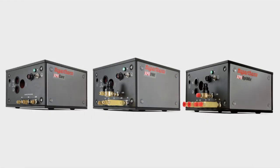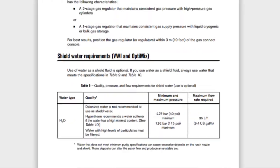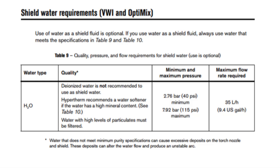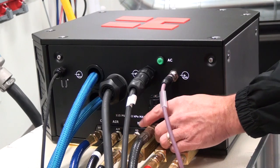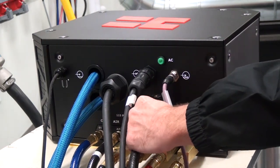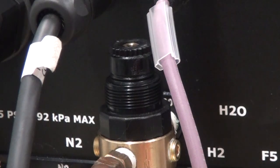If you are using a VWI or Optimix console, you will need to check the shield water regulator. The core console does not use this feature. Using Table 9 in the XPR instruction manual, ensure the water pressure being supplied to the console is at least 2.8 bar (40 psi) and not more than 7.5 bar (110 psi). The regulator on the console is not adjustable; any adjustments will require an additional regulator or boost pump installed on the supply line.